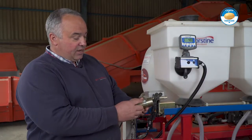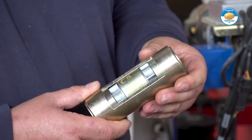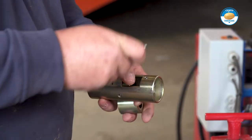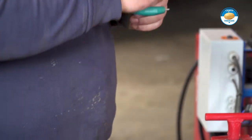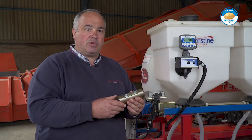This is a metering cassette with the individual metering rotors inside, which then drop the product down through the pipe, through the fishtail onto the soil. Any damage or discrepancy in here will lead to inaccurate and inefficient application of chemical. Simply replacing worn rotors that deliver plus or minus five percent from the intended rate is so easily recovered in chemical savings or increased efficacy. The metering rotors are the most important part of the whole machine — they are essentially the nozzle of the granule applicator.